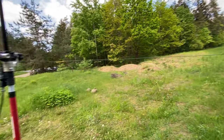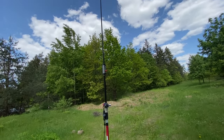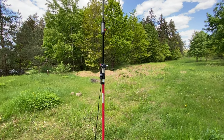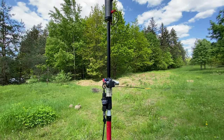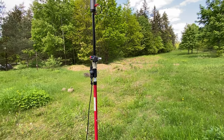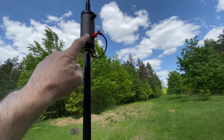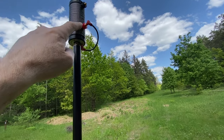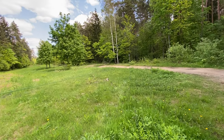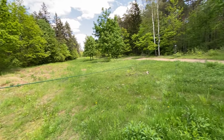It's not really a ground plane system. It's actually an L type of antenna, or in other words, an unusually shaped dipole. So if we consider it a dipole, one counterpoise is enough. It must be elevated, and that's why it's important to find the right tap on the coil, changing the place of the pick-off clips, and then equally important to adjust the length of the other shoulder of the dipole, in this case the counterpoise wire.